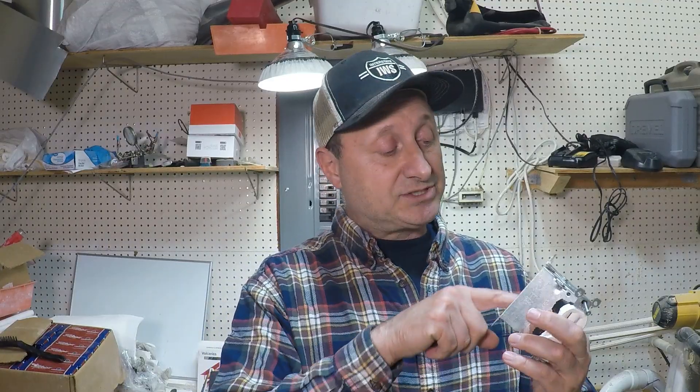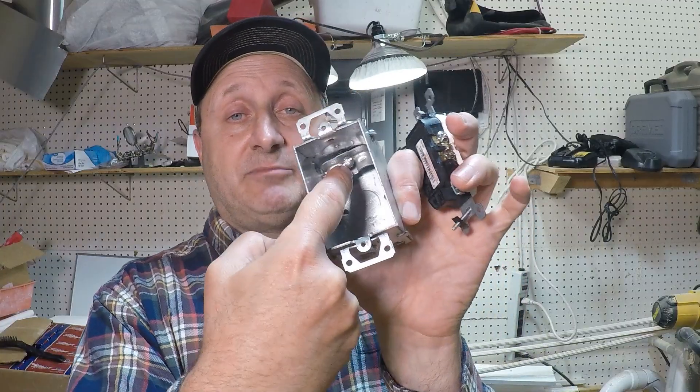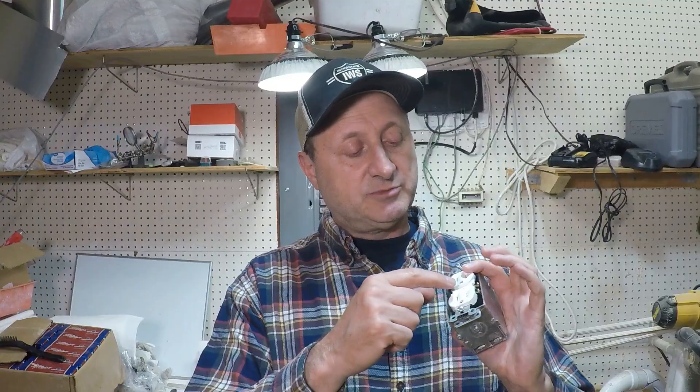Setting plastic boxes aside, the reason why you need to have a ground wire attached to one of the screws in the back of the box is because it's very easy — especially if it's not wired properly — for the wire carrying the load or the power to potentially pop off or touch the side of the box. Maybe someone stripped too much insulation or whatever the case may be. If the hot wire happened to touch the side of the box, the box is now live.